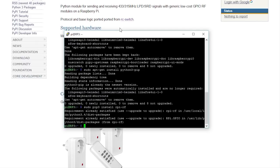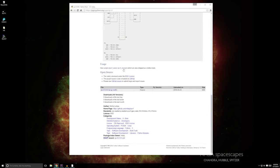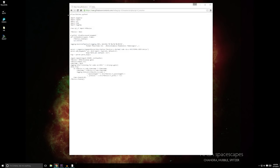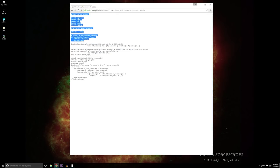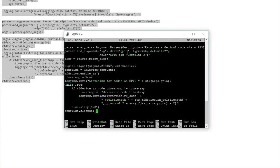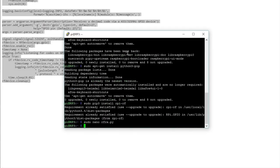Next, we need to create a Python script that records the RF codes. Create a new Python file by typing sudo nano rfrx.py and hitting enter. Next, copy the script that's linked in the description below, and paste it into PuTTY by right-clicking. Save the script by pressing Ctrl X and then Y and then Enter.